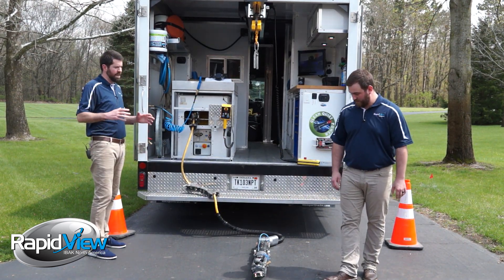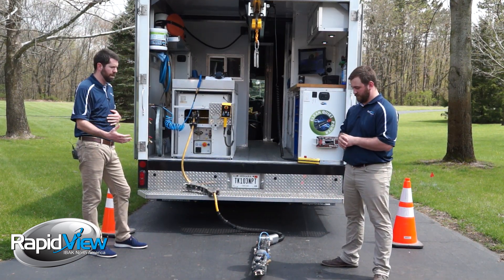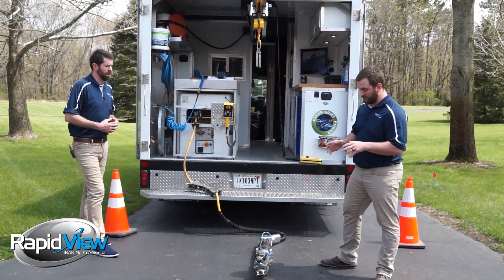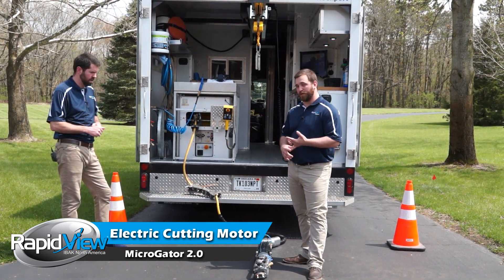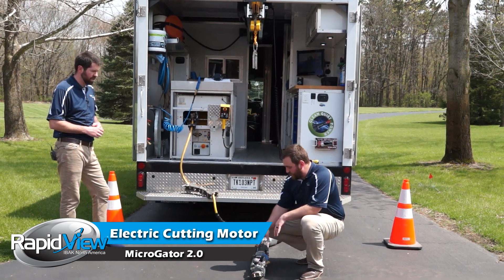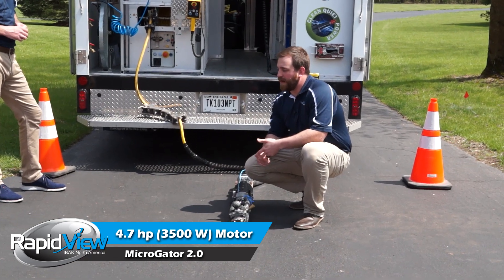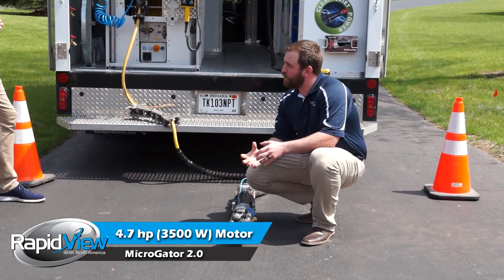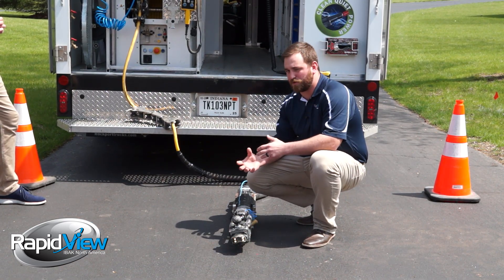If it's not running off of air, tell me a little bit about that motor. It's an all-electric motor, 4.7 horsepower. It is water-cooled, so we are running water to this motor. We're also running water to this camera back here. It runs at 10,000 RPM. You're not going to see this motor bog down like a lot of pneumatic motors — the all-electric motor has a lot of torque.